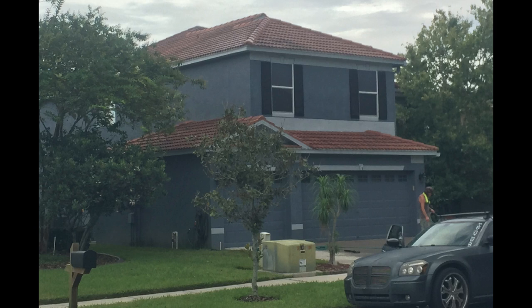This is the opposite, weather-protected side of the roof and as you can see it's not as bad — that's what it should look like after two to three years before it turns fully black. When you have a roof that's only a little bit grown over like this, you can actually dilute your SH 50-50 and get it cleaned a lot faster without having to saturate as much.